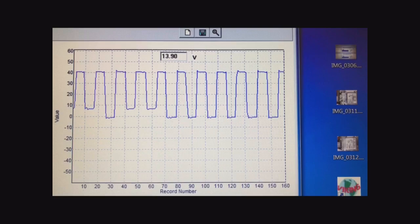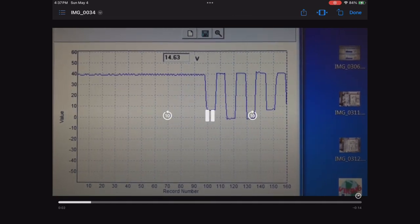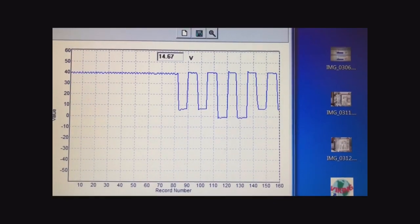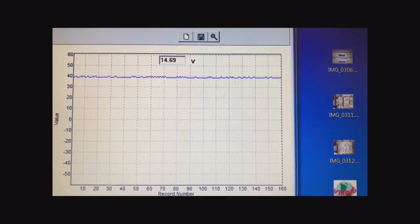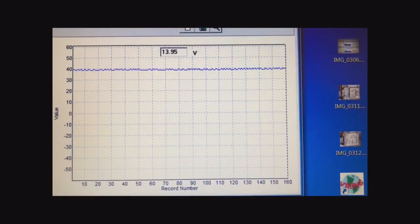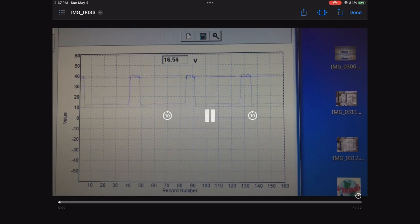You'll also notice if you look at the voltage, and let me just take this back and replay it, DC voltage would fluctuate between about 14.7, 14.6 down to 13.4. That was normal. And that's what you'd see with the DC voltmeter, and that would indicate a pretty decent and working SLC loop. Now, what I found, which was really irritating, and note that it's at 16.5, the voltage would jump up to between 16 and 16.5 volts. So I'm going to play this one for you.